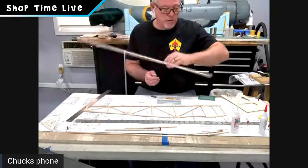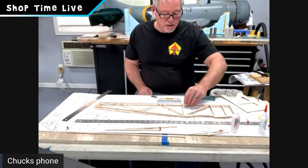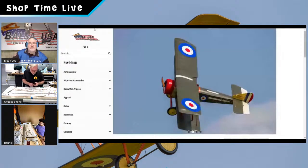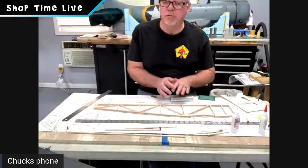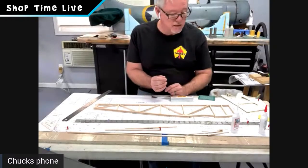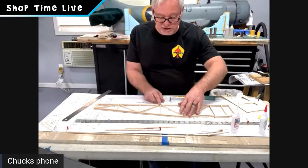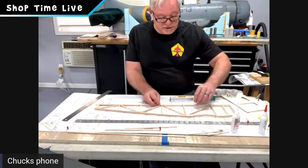I can feel it. And just don't worry about when you guys sand a few sides, just whisk it over. You just want them basically true and flat to each other. And sometimes what I do, even after your first tendency is to blow that balsa dust away, don't do that. You just come back with a thin CA, and actually what that balsa dust does, it kind of impregnates into that little micro gap that you can't normally see. It helps you impregnate in there, and it's almost like a little filler. I don't recommend it for screwing up mistakes or anything like that, cut a brand new piece, but for something that's very minute, it does a great job on that. I do that all the time on some of my other projects, and maybe I'm just picky, and I enjoy the part of the build that even an uncovered airframe looks nice and tidy and clean.